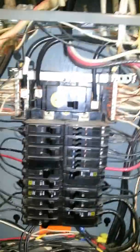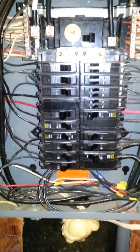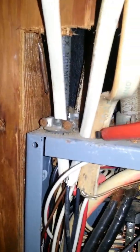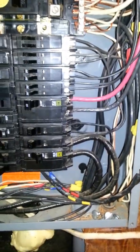They rolled the wire up in the attic — there's like an extra 20 feet sitting up there not even doing anything. We have cable clamps that aren't tightened, and wires going through without grommets or Romex connectors, same way there and same way down here. It's just kind of a mess.